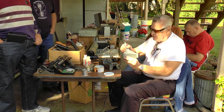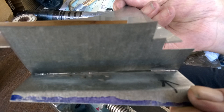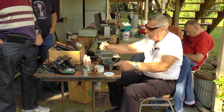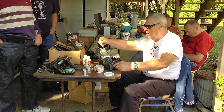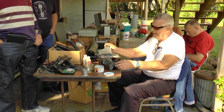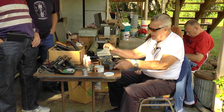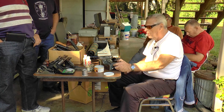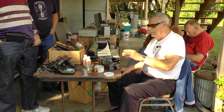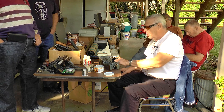On the back side, there's usually no solder — or just a little bit — because it's being drawn back up into the tip. It's not trying to run down the other side unless you do it vertically. Vertically it can run down, because you can't always help it. If you're careful you can do it — I do it — but some people at first may not be able to. It takes a little practice to do it vertical. Horizontal is easy.